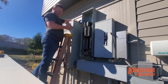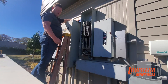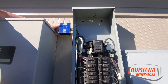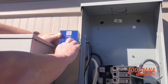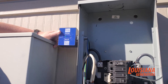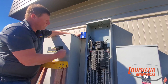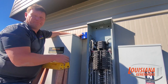Anything from the load side of the meter — which is what powers your house — everything in this panel is protected from any kind of lightning strike or power surge. This unit is mounted on the outside of your panel right here. We turn the breaker on and you'll see the green lights indicating everything is OK. If any kind of problem happens and the buzzer goes off, those lights would turn red instead of green. In the first 24 hours after a surge, the buzzer is very audible, then it gets weaker over time.